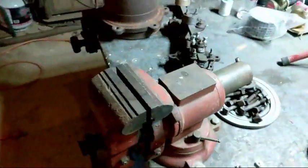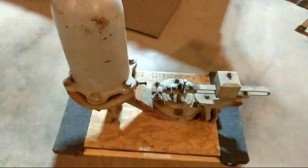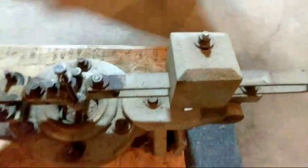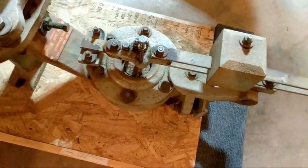And again, the waste valve here has so many adjustments. It's really cool. Here's a side look at it. And I'll show you where it's actually on another ram. You have a counterweight. Oh, rotate device. Sorry, I'm messing the video up. And you have so many adjustments: snifter adjustment, rest adjustment, waste valve stroke adjustment, counterweight adjustment. You can adjust the speed of this down to 40 beats per minute or up to 140 beats per minute.